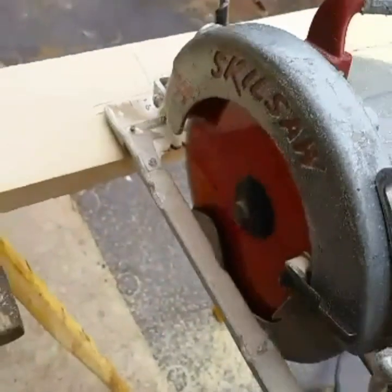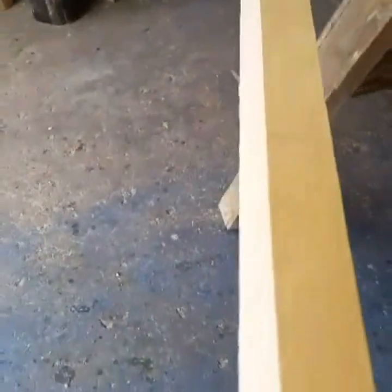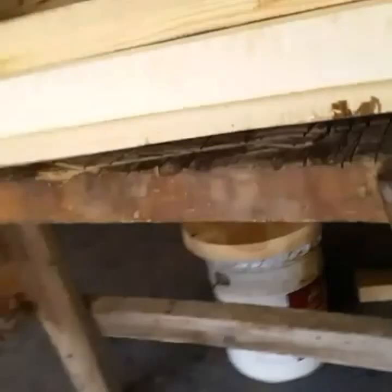Let's grab this and show you how it fits — you can see it's got that chamfered edge that'll hang on the wall. This piece we just cut will hang from the studs on the wall. You mount that to the studs, and then you'll be able to literally hang the mantle from this piece and just bolt it right to that. That's how we make a keyway for a log fireplace mantle.